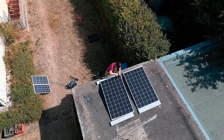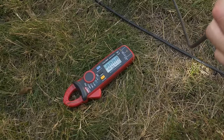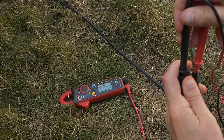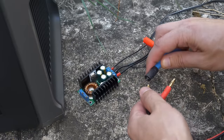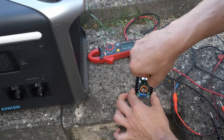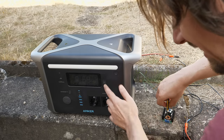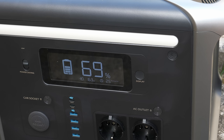I wanted to test one of my big 300-watt panels from the roof. The open-circuit voltage of that panel is unfortunately 36 volts, which exceeds the input limit. I tested it anyway and it simply turns off. I thought maybe we can try a DC-to-DC converter in between. I only found a small one supporting up to 6 amps. I set it to 30 volts to use the most of the 10-amp input limit, but it was limited by the converter and I didn't get more than 160 watts. Still, the converter worked and shortened the remaining charging time to two and a half hours.